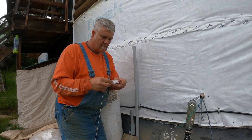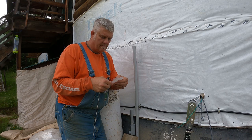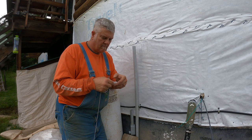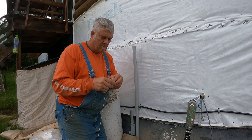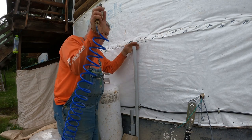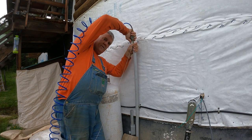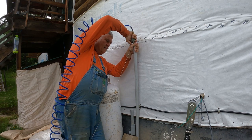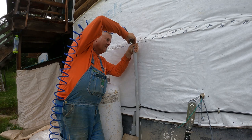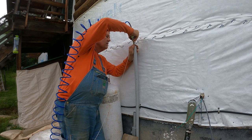What I'm showing you right here is how to put a string through the pipe. We glued all the pipe together, laid it in the trench, and covered the trench over. We're going to put that string through so we can pull the wire through. I'm using a little piece of foam tape or foam packing, tying it in a little wad so it makes like a little kite, and putting that on the end of the string. I used my compressor to try and blow that kite through about 85 to 90 feet of pipe, but that little compressor wasn't strong enough — it didn't have enough air capacity. So we went to plan B.